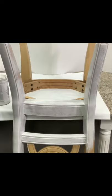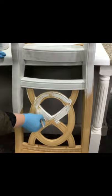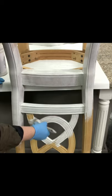You could do it with just the roller, but people tend to get a little bit stingy with the paint using only a roller. Putting on the brush first lets you get back into all the crevices and grooves — so much easier than trying to load a roller. Just load up your brush, get on a nice full coat, and then lightly move it around with a roller, and it makes it so much easier to do.